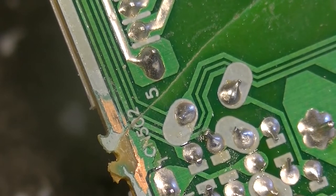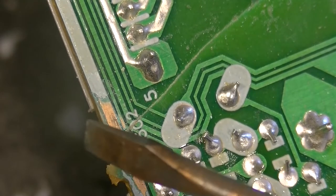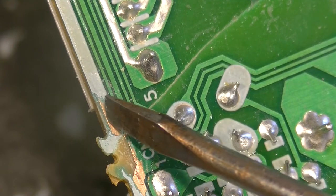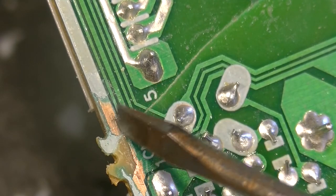I'm back. I have everything fixed except for this area here, which is proving to be a little more difficult. I've been scraping the coating off down through here. I thought this wire connected to this, but it appears it just stops right there. Using the digital microscope for a slight blowup of the image — this trace here is all copper in here, and it goes straight over to this one.